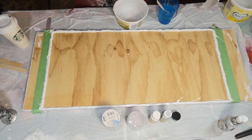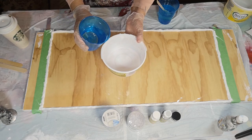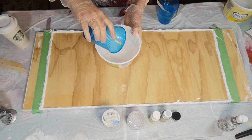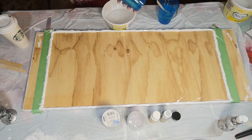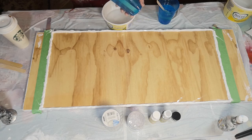You don't want to overheat it because then your resin will set too fast and you'll lose working time. Carefully take the cups out - you do not want any water in your resin, they don't play nice together. Dry the bottoms off carefully. I have a new container to mix in. I won't put it near the oil. I might reuse cups but there could be residual resin.